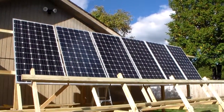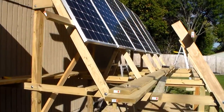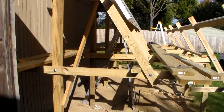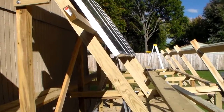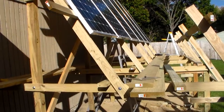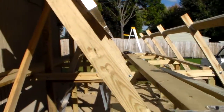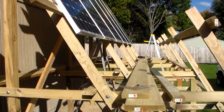If you look down the panels there — the other thing I might mention is when I was squaring this up, I did string a line to make sure that all my 2x members were right on the nose before I lagged them into place. I didn't just go based on measurements; I did that everywhere I could, so that when the panels were ultimately mounted they would be even. And they are — just as dead on as you can imagine. If you're going to build something out of wood, don't be afraid to use a liberal amount of string. Every time you're uncertain about whether something's going to be plumb or level, just run that string. It only takes a couple minutes and it gives you the answer.